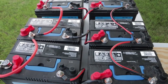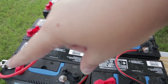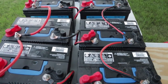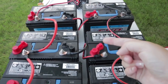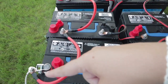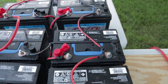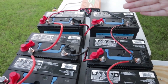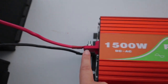As you can see, we have the batteries set up so that all the positive posts are on the left and all the negative posts are to the right. Down the middle we have them hooked up negative, positive, negative, positive, negative, positive — this is what's considered hooked up in series. Then we have all the positives run together and all the negatives run together, which is considered parallel. So we have three 24-volt batteries run in parallel.